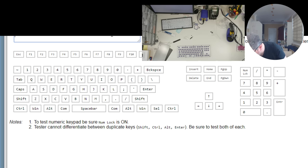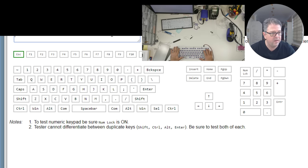And JJ, we're going to start with your keyboard here, just to do a run through test, make sure all the switches are working. If they're not, then what we'll do is a procedure called bridging, just to get them all to go. All right, you can follow along here as I run my finger across the board. Yeah, all of them are working. And then print, scroll lock, and then pause. You can see that. Okay, that means that all of the columns are now working.